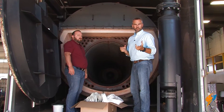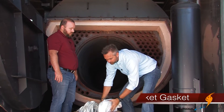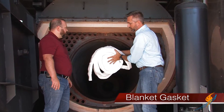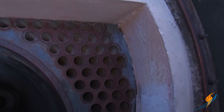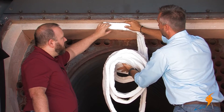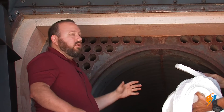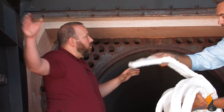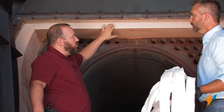We've moved to the rear of the boiler and we're going to talk about three spots that actually need some more gaskets. We'll first start with the blanket. The blanket is used on the front face of this refractory — you'll run it right here. What you'll do is put a little bit of spray adhesive up, let it tack up, set the blanket and run it along the refractory. That gives a good place for the door refractory to seal against, so you don't have any flue gas leakage through here.